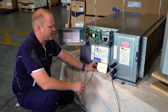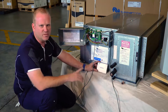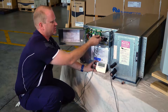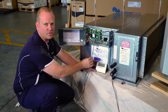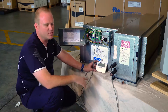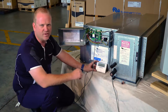Now that we've wired our SAT-3 controller to our IUC board via our client wiring, we're going to look at communications between the indoor and the outdoor unit. This is done via a two-core shielded cable which comes through our electrical panel and is terminated in the same socket as where our SAT-3 controller is terminated. These terminals are A and B and form part of our Modbus communication between the indoor and the outdoor. Again, our polarity needs to be correct from our SAT-3 controller through our IUC and then onto our UCA.